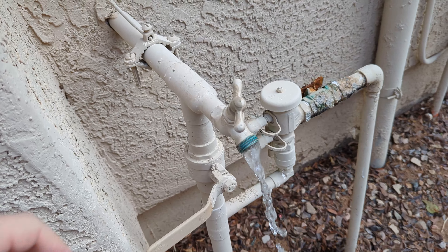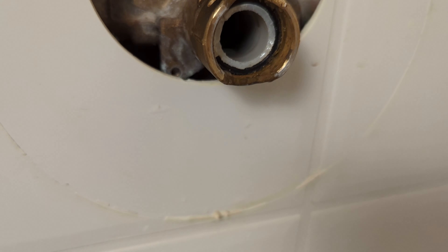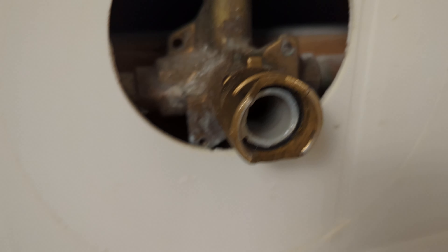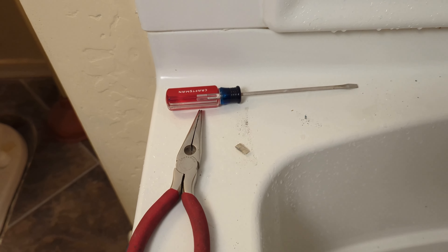Pull this pin right here on the cartridge. Pull out the cartridge with the included cartridge tool or use your own — this puller seems to work pretty good. If you have trouble with this, you might want to watch my full video because I show you some tricks on how you can get this out. If it comes out in one piece you're fine. If it breaks, you'll have to use a pair of needle nose pliers and this little flat head screwdriver to pry everything out.